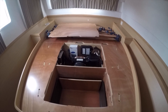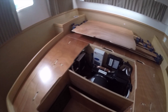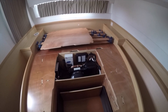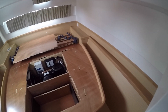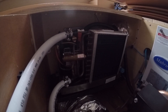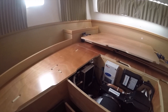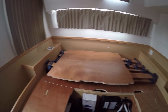Here I'm in the starboard aft cabin of a Lagoon 42. The factory had installed a Dometic 12,000 BTU in here to cool this area. The customer wanted something he could run on a separate battery bank through an inverter, so we came and installed a Mabro 4,200 BTU — it draws just 35 amps DC.